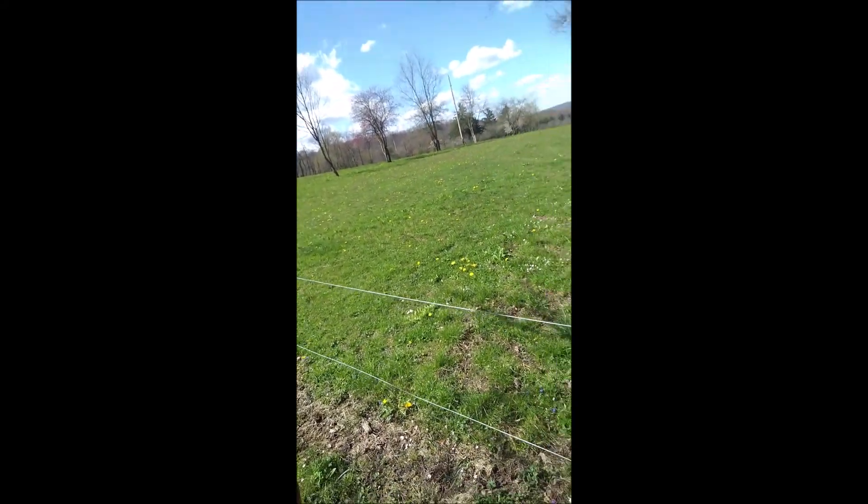The grass is coming in pretty good, so hopefully it'll hold up through the summer. My mom told me that one of the bottom strands here is loose — looks like something hit it and these crimp sleeves may have slipped a little bit, so I've got to fix that and tighten the bottom strand back up. I want to put a tester on it to see how much voltage we've got. Cows have a little higher pain tolerance with electric fences — I like to be closer to four thousand volts, at least above three thousand, to keep them in.